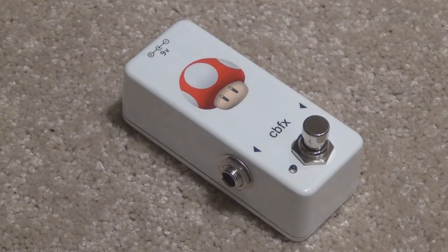The second one is if you've got a lot of true bypass pedals. If you've got a Boss pedal on your pedal board, you don't really need to worry because they usually have buffers in them. You'd have to test that and find out for yourself, but the Boss pedals have buffer switching, so you can actually use a Boss pedal as a buffer. But if you've only got true bypass pedals, you will find that the top end starts to get taken off. From my test of about a month ago, I think it was about 7 or 8 pedals where you started to notice that the top end started to come off, but I'm going to retest that when I do this demo.